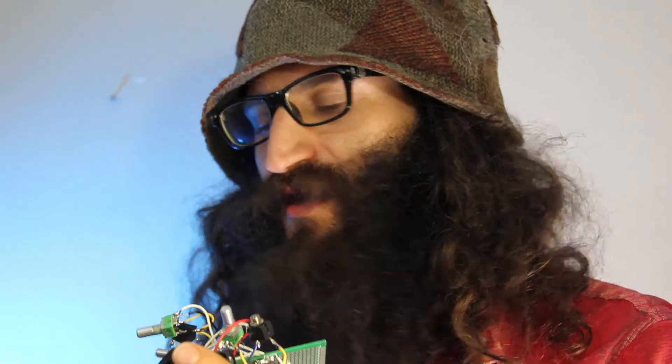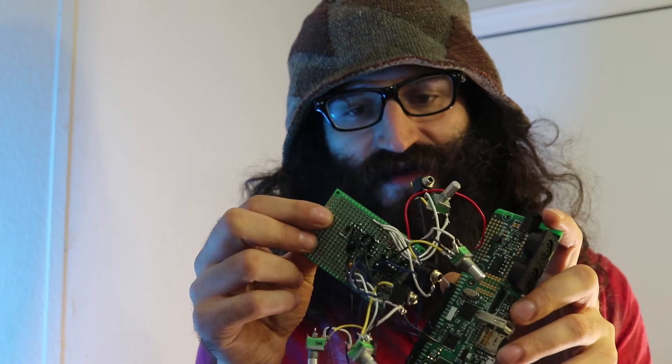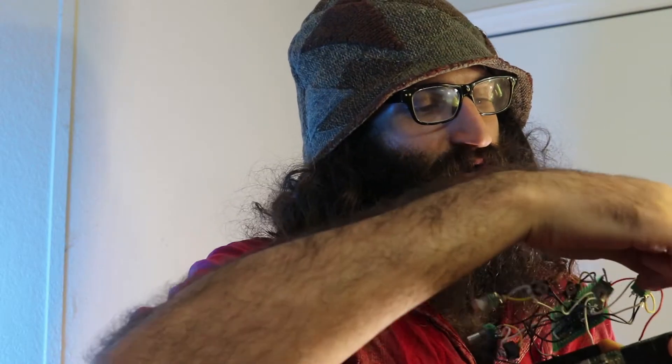I've been working on this thing for over two years — it just keeps getting put on the back burner, because if I sat down and worked I could probably get it finished in 10 hours including the design. This board here is one that I designed and built myself. Right now it has four knobs or potentiometers to control various parameters and four jacks that allow you to plug CV in from Eurorack. It can only take a voltage from 0 to 3.3 volts, so these circuits clip the voltage down to protect the circuit. It doesn't attenuate it, but you can use these guys as attenuators for that signal when you're not using them as control offsets.